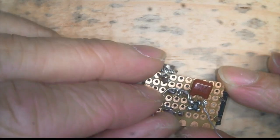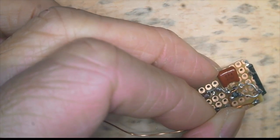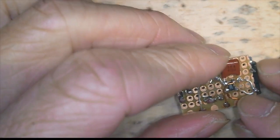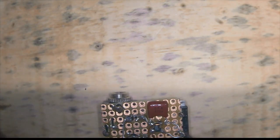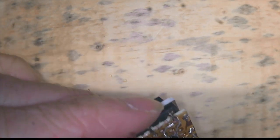Next, let's solder in the capacitor. I use insulated magnet wire for connections and wiring up the rest of the components. It's very easy to solder, and the insulation layer — which is a layer of paint — will only melt at 300 degrees Celsius or above, so it's pretty safe to use. It's much better than using regular wire with rubber insulation, because that rubber will deteriorate over time and make your circuit very ugly in the end.